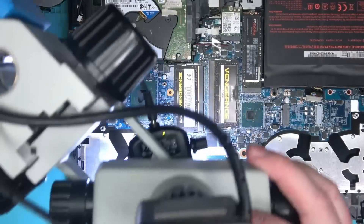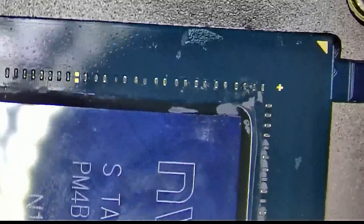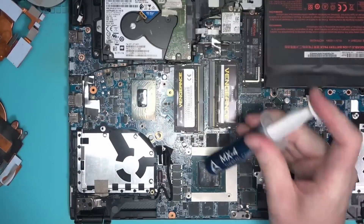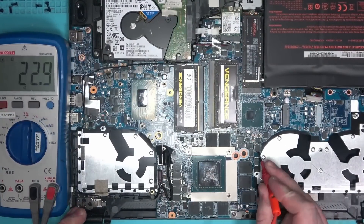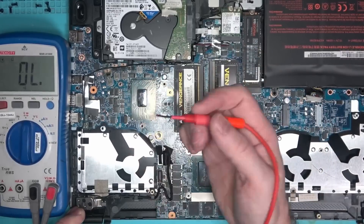But before I do that, I want to make sure we don't have any drops of liquid metal anywhere, so scoping around the board is the first thing to do. I also want to check for any shorts by poking every coil on the board, while completely ignoring the actual readings, because at this stage the only value I care about is short.